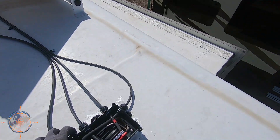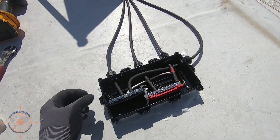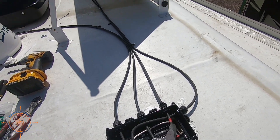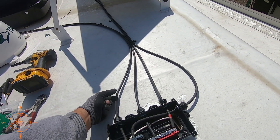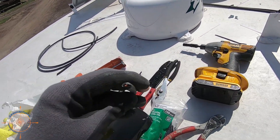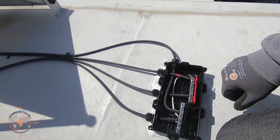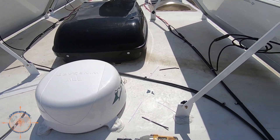You don't want too many screws in your roof. Here's the junction box — you can see my positives coming in and going down my pre-wire. These wires look bigger but they're actually only one size up from the pre-wire — I used number eight because that's what I had on hand. All the solar panels have number 10 wire. The reason it looks so big is that this wire is UV-protected so it can lay on the roof without sun damage — it's got a super thick coating on it. This is all sealed up around the box. I'll put the lid back on and then just seal the attachment points and put the panels back down.